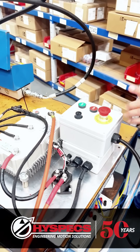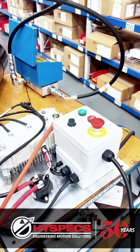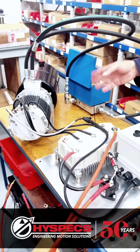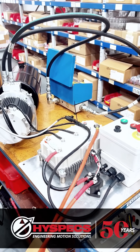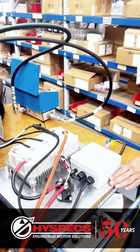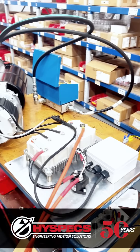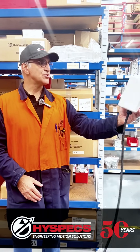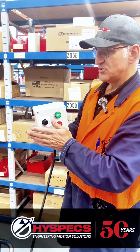As with all brushless motors, we can control the speed. Let's give it a run to see the sound and some numbers. It's not optimized because the power pack has a very high pressure drop, but it's sufficient for our needs. For the customer, we put together all the electronics on one plate which they can stick on the wall nearby the power pack. They can also mount the power pack vertically, and on the wall near the winch they will place the controls — in this case a speed control, start/stop, and an emergency button.